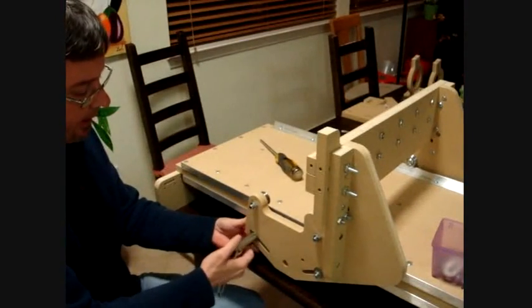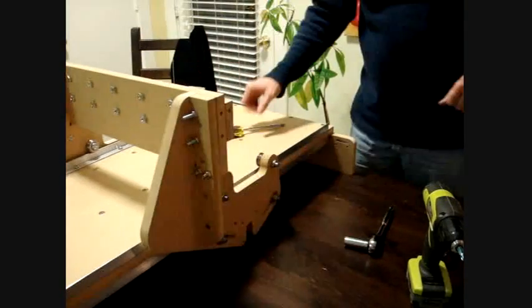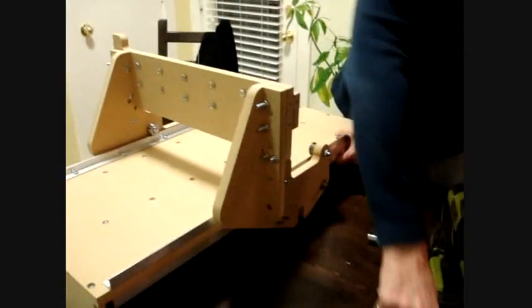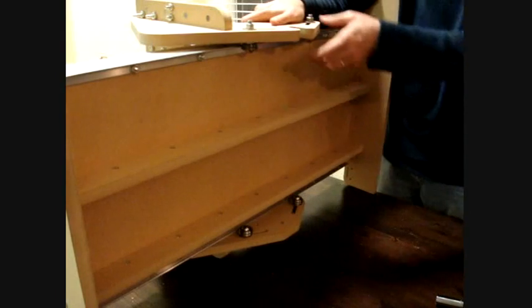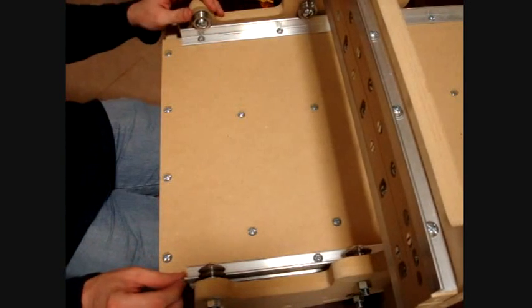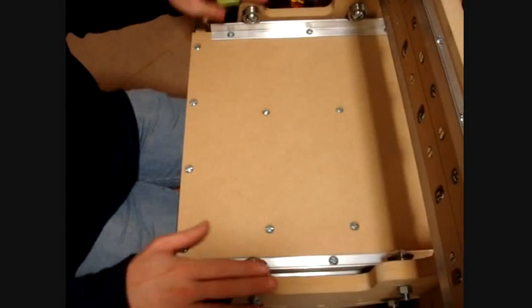When you're tightening this side, tighten it so it pushes it this way at the same time. It should feel pretty firm while it goes down the rail. Since this is the clear area underneath — there's a space here for the motor and it won't get in the way. You'll also have a shaft coming from the back of the motor to this location, and it will still be cleared since this is only a quarter inch shaft. Now that you've fastened the X-axis and it's rigid and solid, this one is still moveable but it's going to auto-correct. Tighten the screws while the gantry is right next to this location — if it's over here there's too much adjustment. Make sure it auto-adjusts at this location when the gantry is to the side.